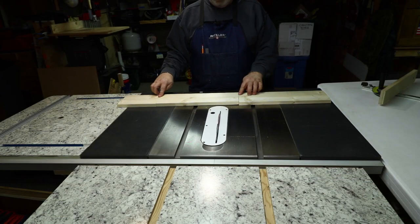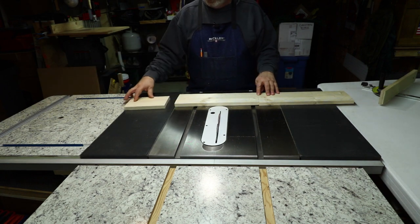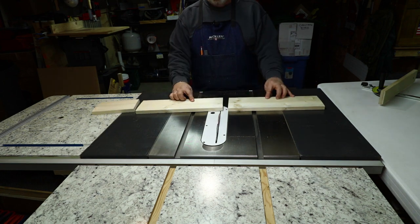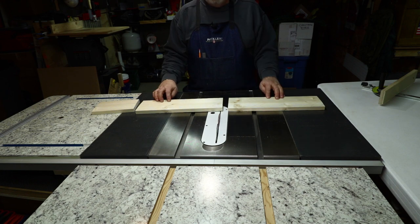I've made three cuts here: one to take off the excess board that I don't need, another to separate these legs out, and these two pieces will be the brackets that will hold the shelves. I'll go on further to make some 45-degree cuts, then go to my table saw and band saw for making the different slots I need.